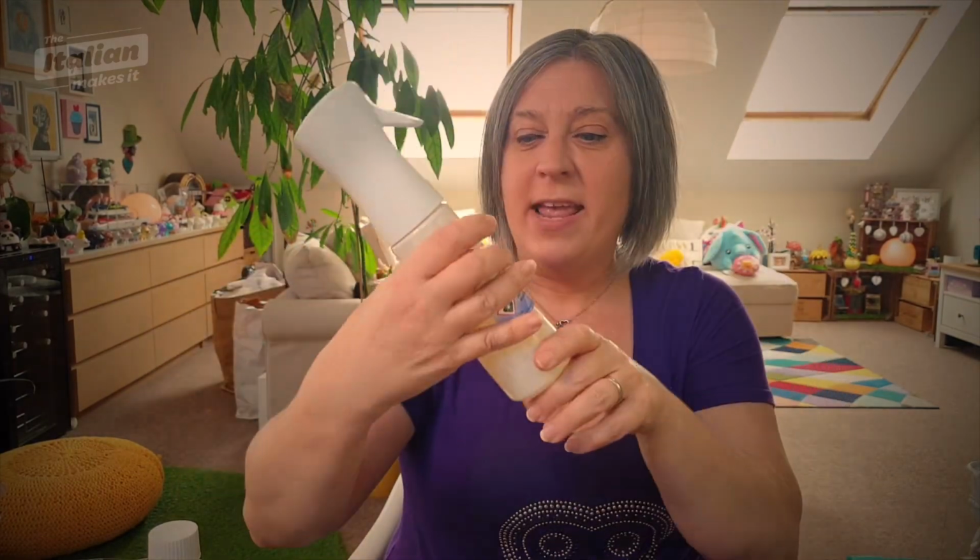And also because when you use really squidgy silicone, the surface is very sticky. So they say to roll it in either talc powder or cornstarch, which will help smooth it out and stop the stickiness. But also this kind of silicone will stick to silicone, so you need to use a mold release agent. So I bought this together with the silicone, but I think I got conned. It suspiciously smells like WD-40. So I should have stuck with that. If only I knew. So I've got my mold release spray. They call it liquid wax, to release the elephant from the mold.